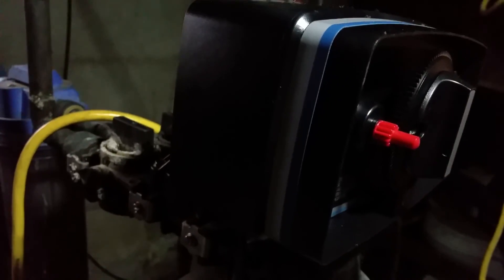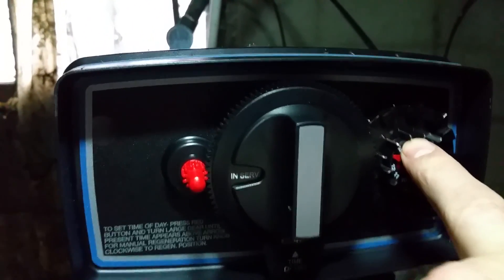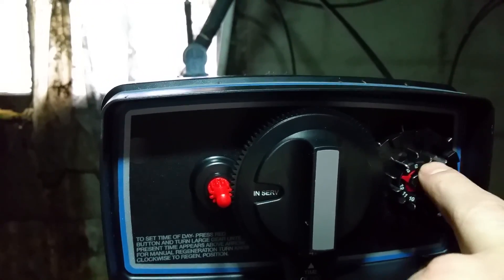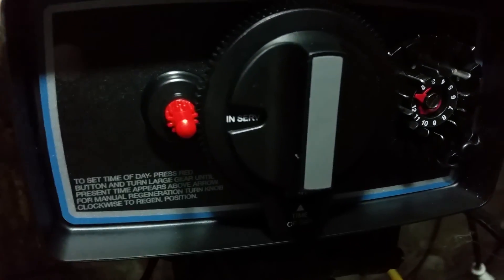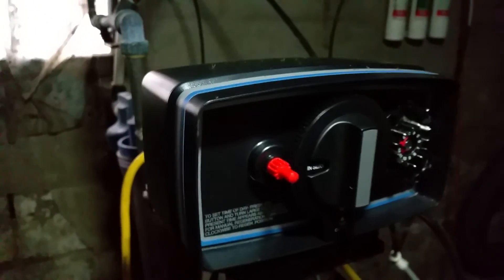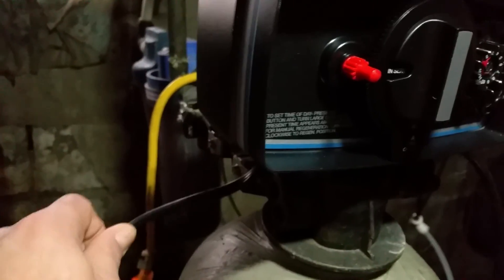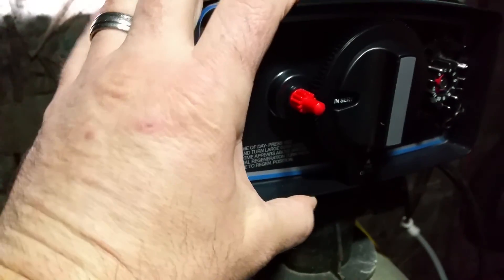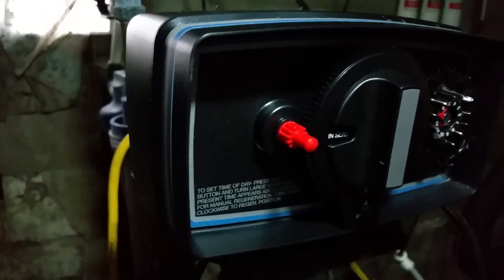Every night a tab is pulled out, that's when it's going to regenerate. If you want every other night, you skip tabs alternately — the whole dial covers 12 days total. Most people do it the opposite way, using the flow meter so it only regenerates after a certain number of gallons. If I go on vacation, I just unplug it — the valve and filter still work, the timer just pauses. That's it, we're done.